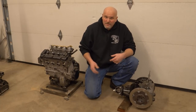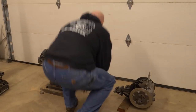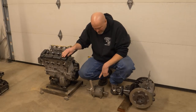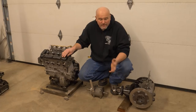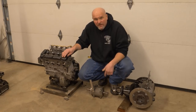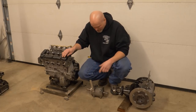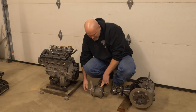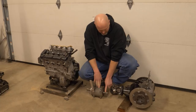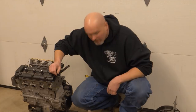I got a solution for that. This little guy is a forward-reverse gearbox that used to be sold by a company called Roadster Cycle. It's a very heavy duty unit rated for 500 horsepower, so it'll be fine behind this motorcycle engine. The cool thing is I'll just have a driveline coming out of the engine to this unit, and then a driveline from here back. You can just switch directions with this lever here, so we'll have six gears forward and six gears reverse.